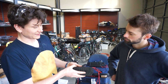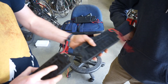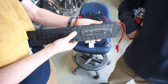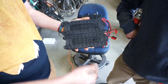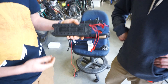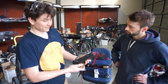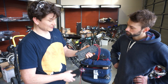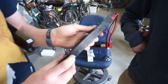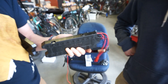The geometry allows the packs to snap together with little plugs, and they also interlock end to end. Depending on the shape of your application, you can stack the batteries in a number of modular fashions to build up the capacity you want. You can also connect them in series to make 72 volt or 108 volt battery packs. We have two versions here — one uses a very basic battery management circuit, while the prototype on my left uses our own in-house BMS system with an embedded set of LEDs under the surface, communicating the state of charge.